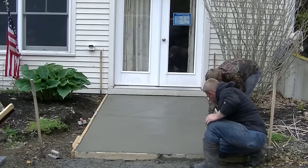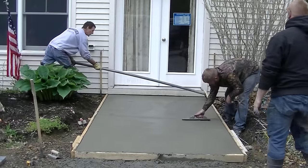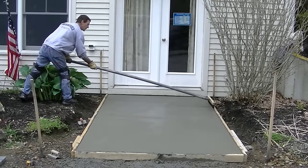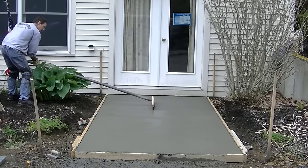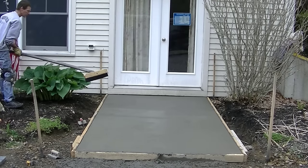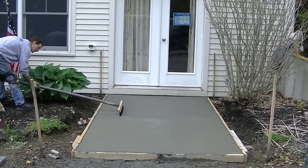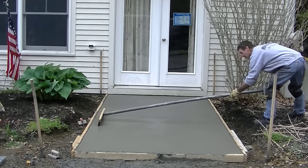You could actually stamp this — if you were going to stamp a pattern in the surface, this would be the time to do it. I've got a two-foot concrete broom here and I'm just going to lightly drag it across the surface, nice slow and easy, and then that's going to be the finished slab. That's a good, nice non-slip type finish. The concrete here is going to be very strong and durable throughout the entire mix because it was mixed evenly. If we want to cure this thing, say the next day, to make it cure slower and get even stronger, we could just keep wetting it down for a few days and not letting it dry out too fast.